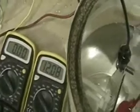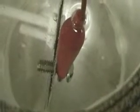Remember, there's no electrolyte in here. We're going to hook it up now. We're looking at 12.08 volts and we're hooked up. Take a good look at this. No electrolyte — no action. Well, we do have a little action, not much but something. Remember the plates are one sixteenth of an inch apart. You can see just some action starting.